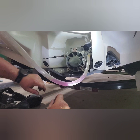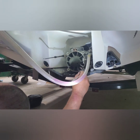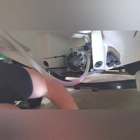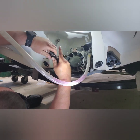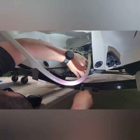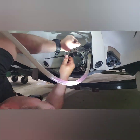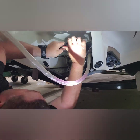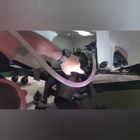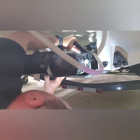I just have to put the big black o-ring on here and then I can slide it back on. I just got the pump slid back in and all I have to do is put the four bolts in. It did engage in the splines, obviously, or else it wouldn't go. I did put some actual tire lube on the o-ring — it's the big black o-ring that goes around. The best way to line yourself up is put two bolts in the nut so you can hold it together to get it up in there — we're not trying to line up two things at the same time.